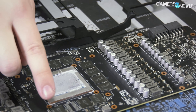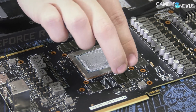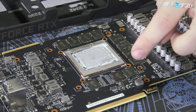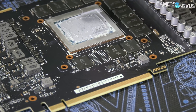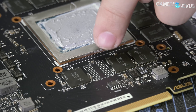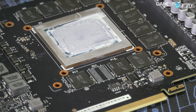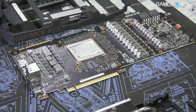For memory layout, you'll see there are 11 modules — because we have an 11-gigabyte card, so you end up with one gigabyte per module. There's one missing module. Part of this will be explained once we get the thermal paste off of here — the name on the GPU indicates which memory module is missing from the card, but it will be the same for each identifier. Let's clean that off and figure out which one it is.